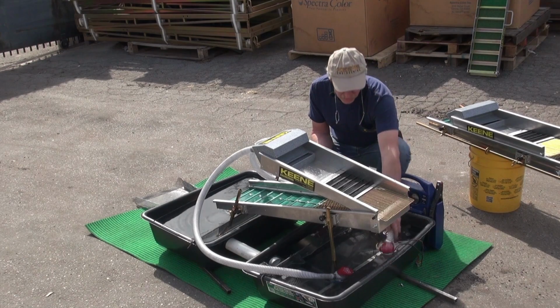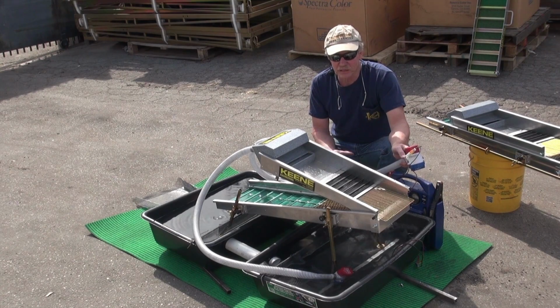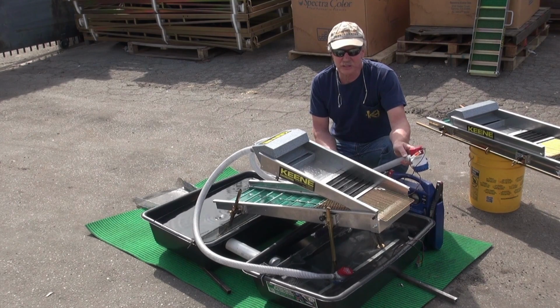So if you look right here, I'm using two small 12-volt water pumps, and these pumps are around 1,100 gallons per hour plus. But you want to run as small a pump as possible because you want to pull as small an amperage as possible. Right now, when we're running the battery, we're probably pulling close to about 5 amps combined amperage to run these pumps. But if you put back pressure on them, you're going to pull more power, and then you're also not going to get the same amount of water flow.